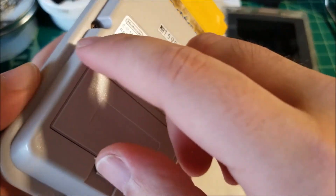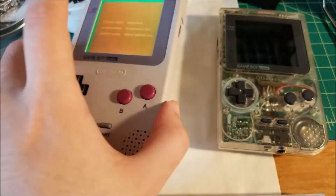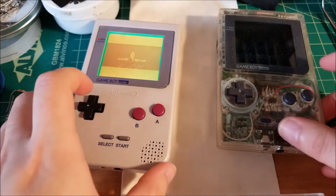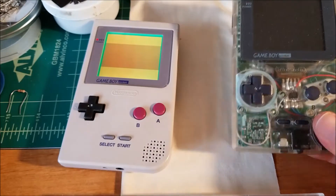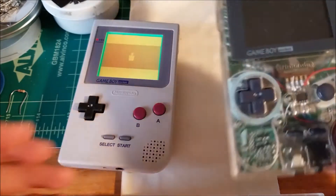I'll show pictures, but I've directly surface mounted the chip in the side here, and I scraped off a bit of the ground and soldered it right to the board itself. No extra circuit board, so that means it's a lot cleaner and there's a lot less fiddling to do.